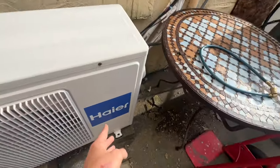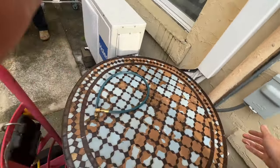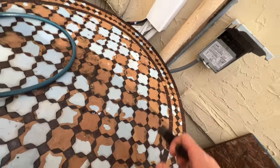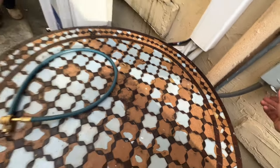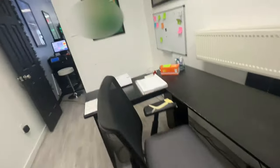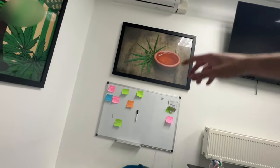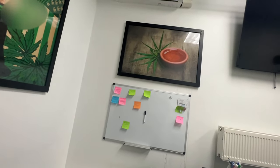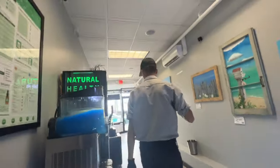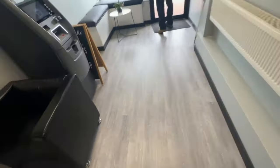Here's our outdoor unit — I've never seen this particular brand of ductless before, but that is what we're working with. First things first, pull power. Hopefully power actually shut off — yeah, it did, spinning slowly. I'll show you the indoor unit. This unit right here, we're moving it down enough so that it clears the steam pipe. We'll set up the six-foot ladder here and we'll be replacing the pump inside too. And then this is the other unit, which we'll be doing a maintenance on. I brought the coil cleaning kit in case we need that.